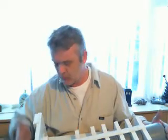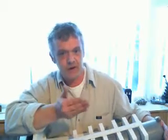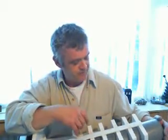Now don't try to saw all the way through because the chances are your saw's going to drift. What you want to do is use a hacksaw, saw part the way through, then turn the pipe and continue sawing, following the line as you saw. You get a pretty good finish that way. You can clean up the rough edges with a trimming knife blade and it scrapes clean really, really easily.